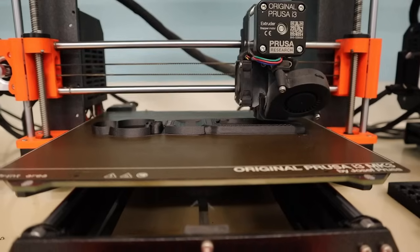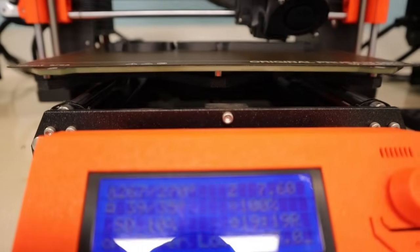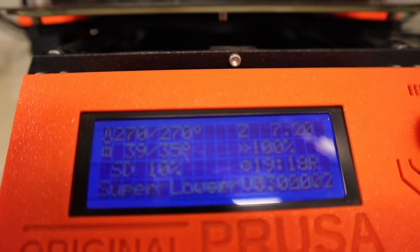The second thing is prepping your printer. You're going to need to be able to get your hot end over 255-260 degrees Celsius — the limit of a semi-metal hot end. A stock Ender 3, for example, has a hot end limited to around 260 degrees Celsius, and without an all-metal hot end you can't really get hot enough to effectively print nylon. I print at 270 degrees Celsius. More testing might show a little lower or higher is better, but I've gotten good results at 270 degrees Celsius, so you're going to need an all-metal hot end.